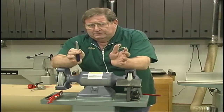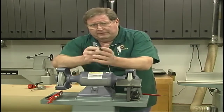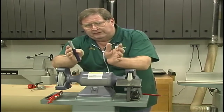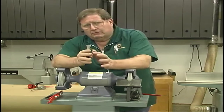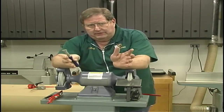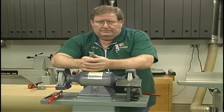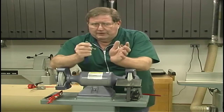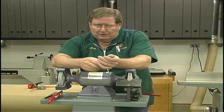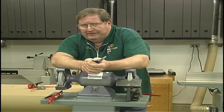A few tips: before you turn that grinder on, roll that jig over. Make sure that tool is going into the position that you really want it to. Don't grind the tool away making mistakes — stop, look, think. The jigs will do whatever you want them to; you have to make them do what you want. I'm Dick Singh and the jig is up.